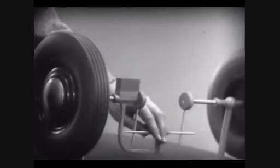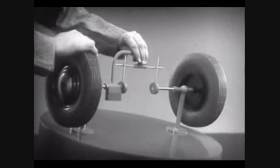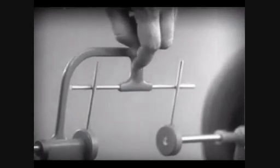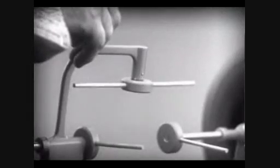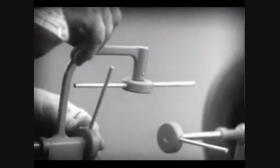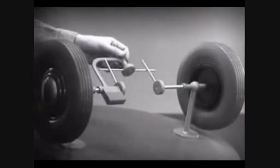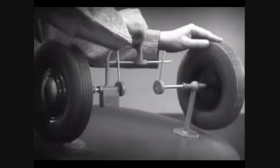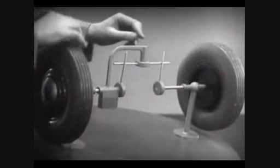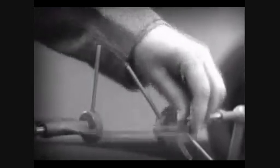And if we stop one wheel, the other wheel won't budge. Let's put this bar on a pivot so that it can swing in either direction. Now the bar can still turn both wheels at the same speed. And because it pivots, it lets one wheel turn even when the other is stopped. But if turned too far, the bar will swing around until it won't drive the spokes that turn either wheel.